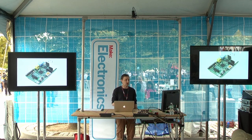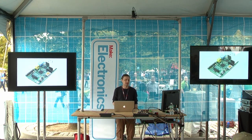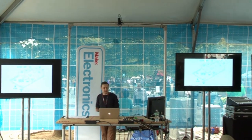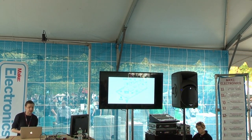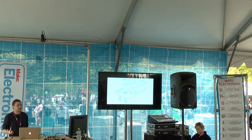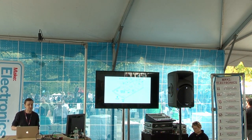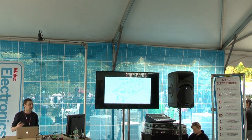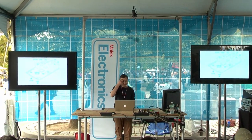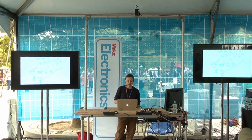And it suffers for that — it's not designed to talk to hardware. However, at $35, it's pretty much a no-brainer if you want to talk to hardware from a single-board computer and your uses are pretty limited. The Pi is a large step up from the Arduino in terms of processing power. It's designed to run Linux. It's got a lot of the same interfaces as a regular computer — HDMI, Ethernet, USB. Basically, this is a little computer on a board. Programming for the Pi is very similar to programming on your laptop. It runs off an SD card, boots Linux — you log in via Secure Shell or attach a monitor and keyboard and bring up a desktop. It's got some general-purpose pins, but talking to arbitrary hardware is actually pretty hard.